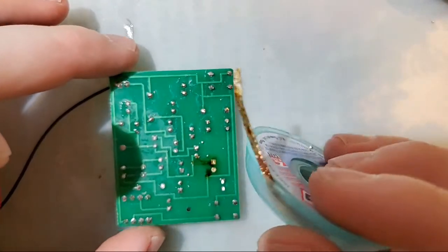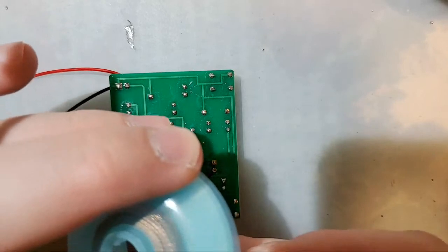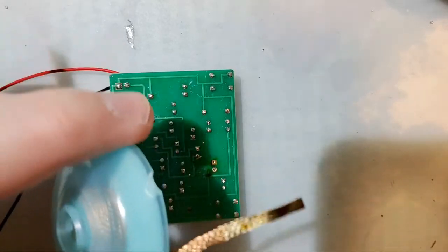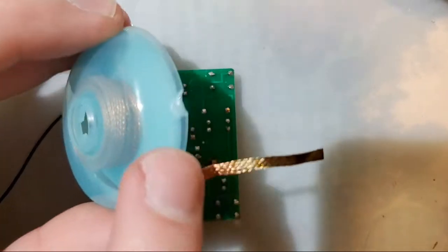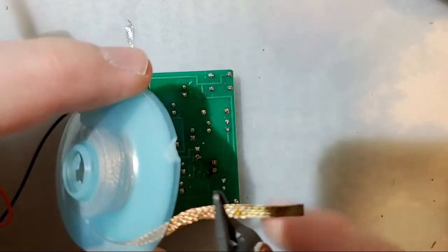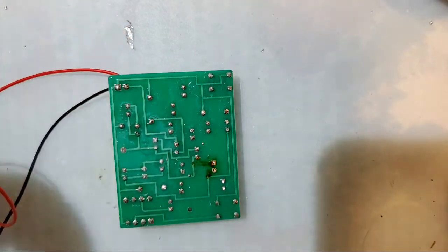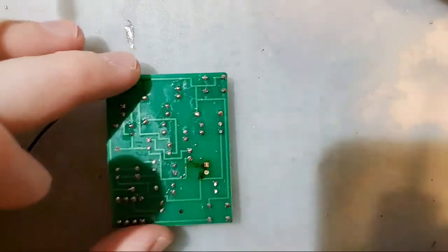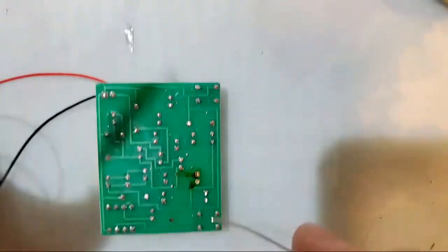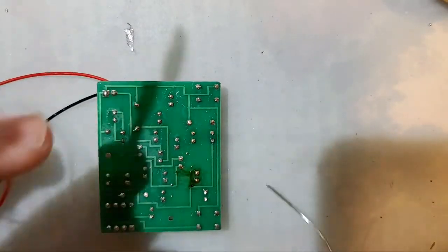All right. So yeah, that's the wick, and some people prefer the wick. I prefer the pump in most cases. You should also unroll it a little bit more, lest you melt the casing like I just did. But that's what your fume extractor is for, so you're not inhaling that. I'm going to add some solder back to these joints, make them like regular joints.